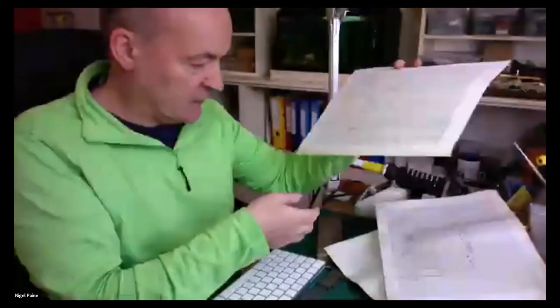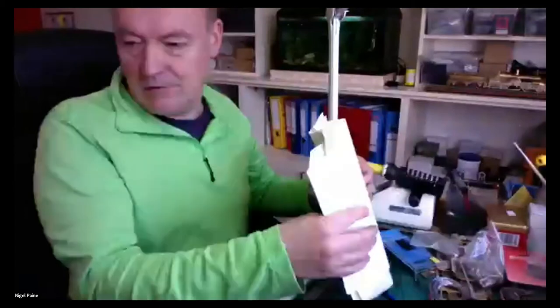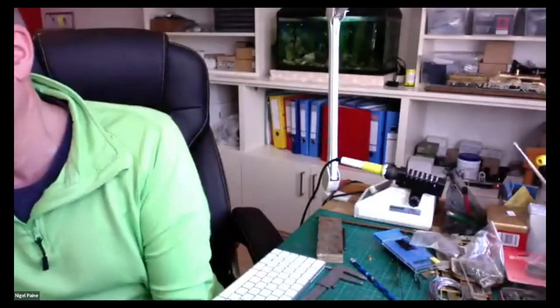One of the biggest challenges I've got is, if you look at the wheel spacing, can't move my finger, there you go, it's incredibly close. So I've actually had to ease the frames, the spacing of the wheels, out by a couple of mil, so that the flanges from the loco will not touch.